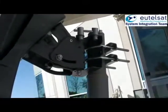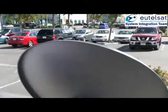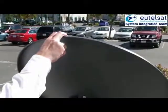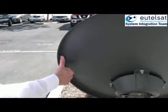The last phase is the pointing test. Push and pull the antenna as shown in the 4 points. Be careful not to deform the antenna. If the antenna comes back to the continuous tone, the antenna is well pointed.